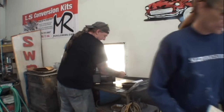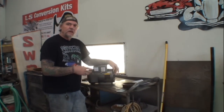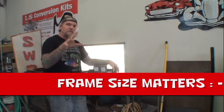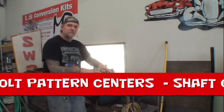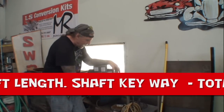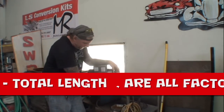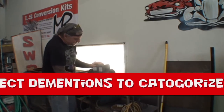And another thing about getting a compressor motor is you gotta make sure that the compressor motor fits on your frame. Now when I say your frame, I'm talking about all the holes that are drilled out on the top of your air compressor. There's different frame settings and different frame feet. So you gotta know that you got the right one.